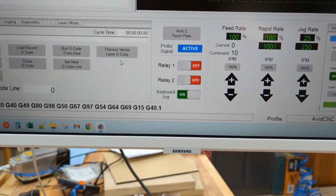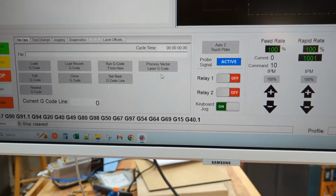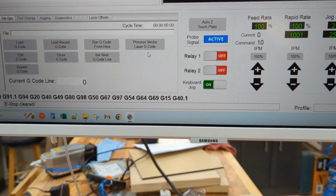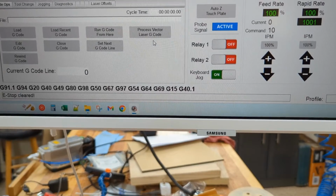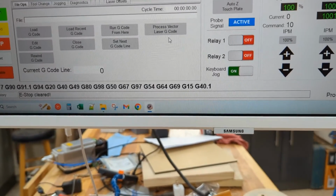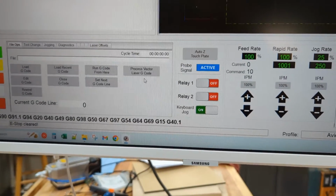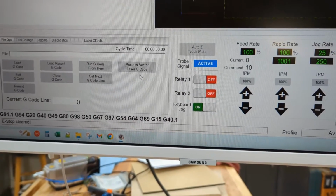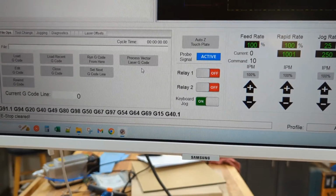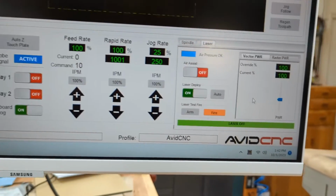They post-process the G-code file, and based on the tool number that you select, it knows that that piece of G-code is for the laser. And so they post-process it and change the G-code, basically you're treating the laser as an end mill when you generate it, either in Fusion 360 or in Vectric or something else. But the cool thing is this is really generic for any kind of CAM tool that you spit out. It will just convert that portion of it to laser. So again, you end up with a file that can run both spindle work and laser, and that's really unique. And I think for people doing production work where they want to do all that in one shot, it's really cool.